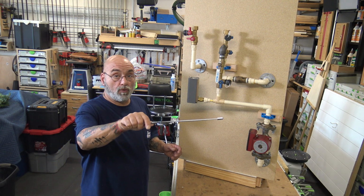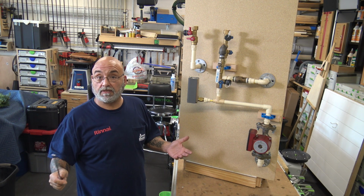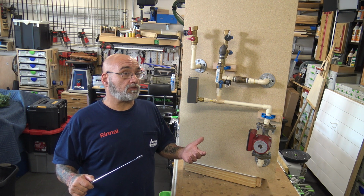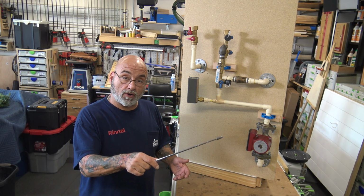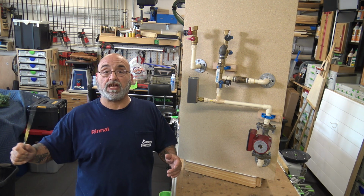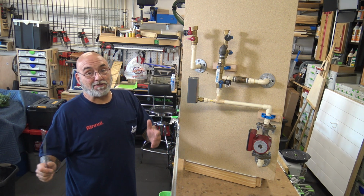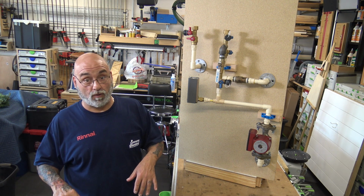We will put an RU to accompany an RUR in a large bed and breakfast or a very large home, which we're doing, a 15,000 square foot home. It's got about 12 bathrooms and hair sinks and pedicure chairs. We're putting one RUR and one RU on one side, and one RUR and one RU on the other side. We link them together. We put the communications cable first in, last out. Circulator goes into this, couple of check valves, Bob's your uncle. So I can't tell you the last time that I actually put one of these in, unless it was a commercial job, but not in a residential home.